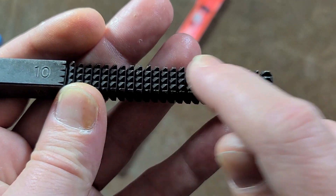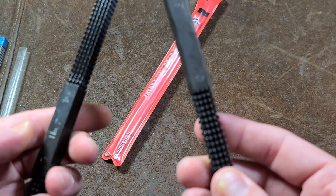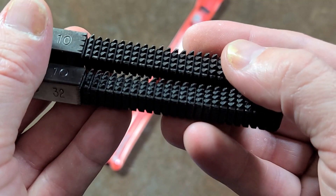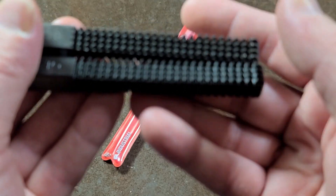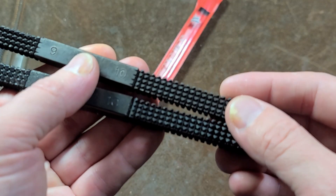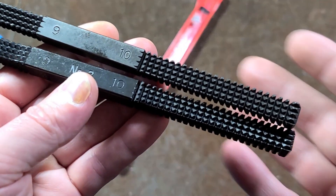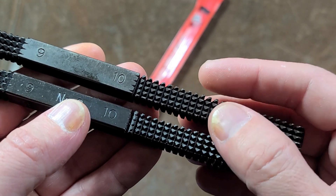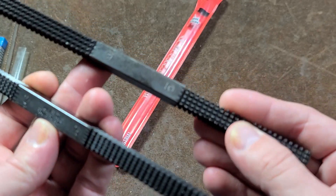These were broken during manufacturing and then it was heat treated. With this thin edge, when they're cutting the teeth on this bar, on higher quality ones — if we compare to the NuThread — you can see what NuThread does is they know it's going to be thin and it's going to break. So they actually intentionally machine off that thin little edge. That's one of the differences of a much higher quality one versus this Vermont American. Even though these are both American made, I was pretty surprised, because I assumed they were all made in the same factory. These may just be lower quality ones resold to other manufacturers, and only the good ones are stamped NuThread.